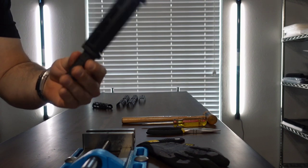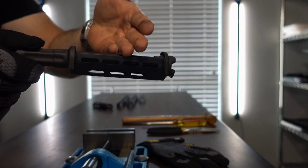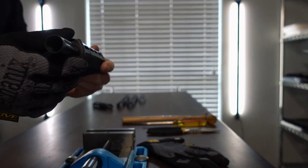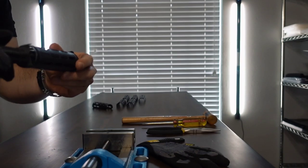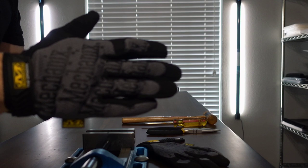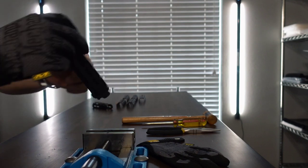We are at the final step. We've got the upper hand guard seated at the bottom of the gas tube and we simply need to rotate it 180 degrees into its final spot. This is probably the step that takes a little bit of muscle — we designed these to be tight. If we didn't, they'd be rattling around once in place, and that's no good. I recommend you put on a glove and use a vise, vising the rear lug area of the gas tube just like before.